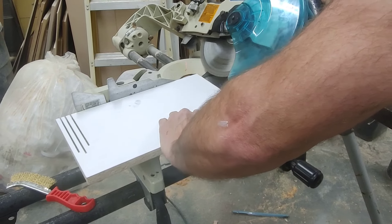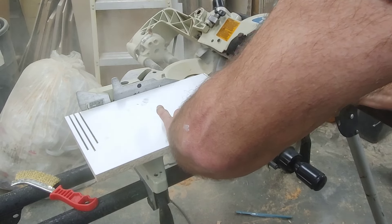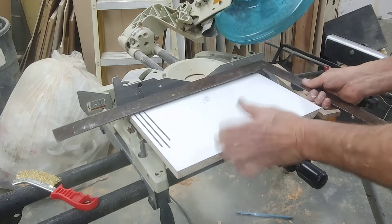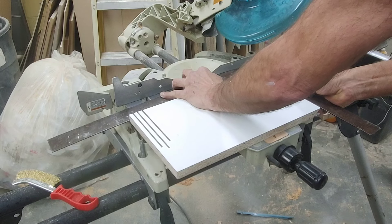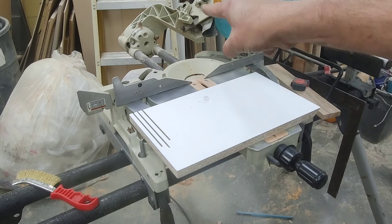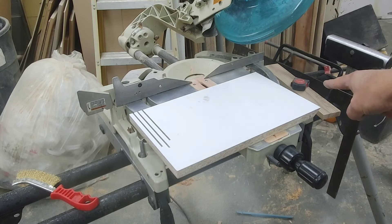So here's what I mean — that's a miter on about an eight inch piece. 100%. Make sure you lock down your handle at the backside when you're running miters, because that has to be perfect when it runs that cut.